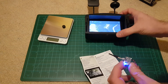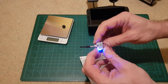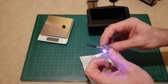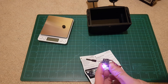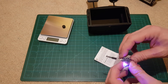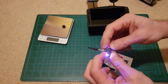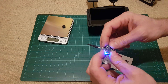Now how to change the band. Changing the band, as the manual says, is by pressing this button for more than two seconds — and now the red light blinks. You also change band by pressing this button. On band A, the red light will be on all the time. On bands B, E, F, R, and U, you won't see any notification, so you just have to count. Press for two seconds: A, B, E, F, R, U, and A again.